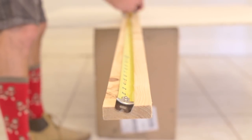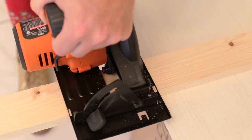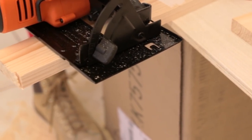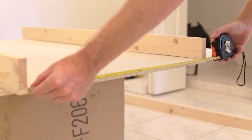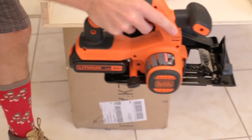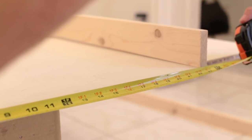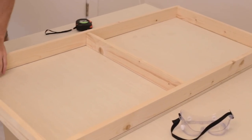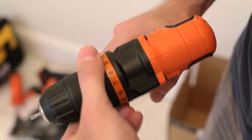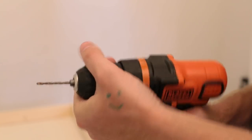Once you have all your materials, it's time for assembly. We had our plywood pre-cut at the hardware store, so we just needed to measure and cut for the side pieces and legs. Using a circular saw, we measured and cut two of the 1x3x8 boards to 4-foot lengths to get 4 long frame pieces total. Then we measured to double-check the cut size for the smaller frame pieces. We added a cross piece in the center for stability, so we ended up with 6 of these boards at 22 and 3/8 inches. Once those were cut, we lined up the frame pieces on top of the plywood to square it up.